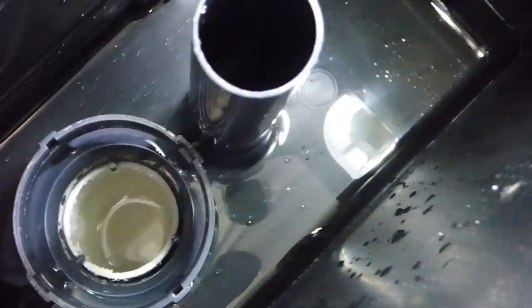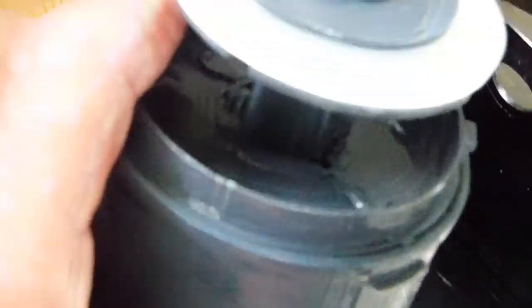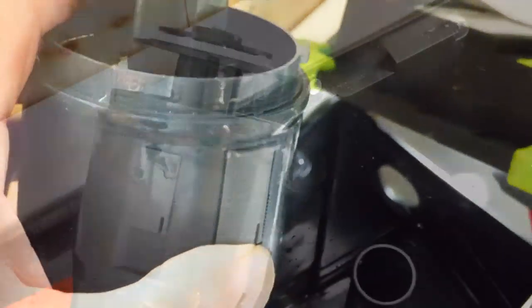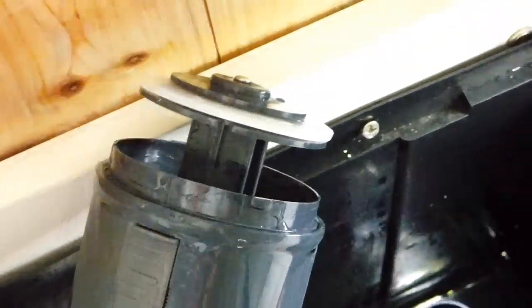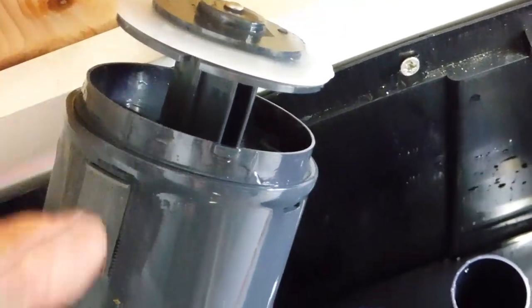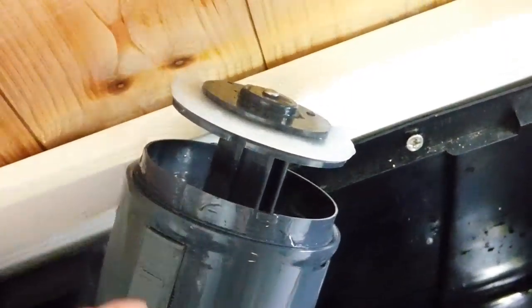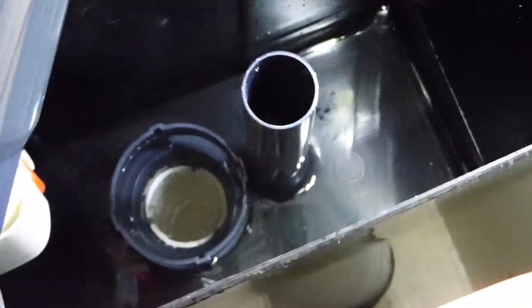It's pretty routine really - just check, you can run your finger around it if you're not sure. The main other thing that can go wrong is this siphon with the washer on it. Having checked that, of course, one other thing - if you do have one of these and it still doesn't go, you could always get another siphon and just renew this middle part here. I'm not sure whether you can get just the internals, but if not, just get the whole thing and just change the actual working bit - leave the whole rest of it still there, which is handy isn't it.